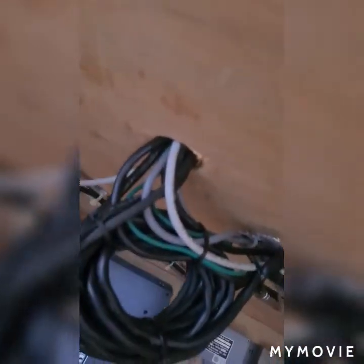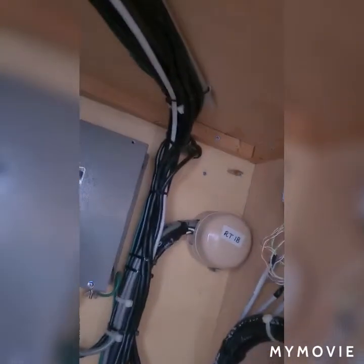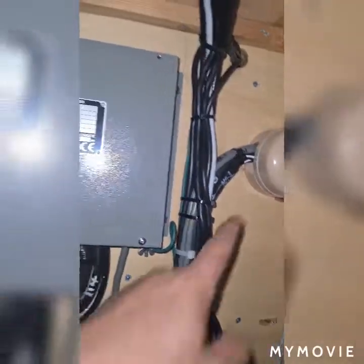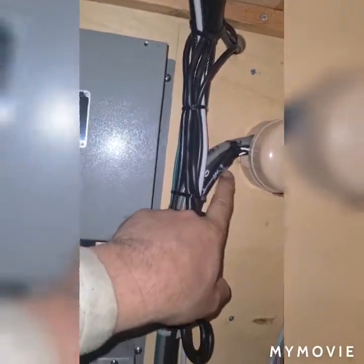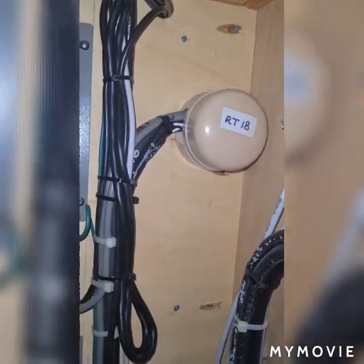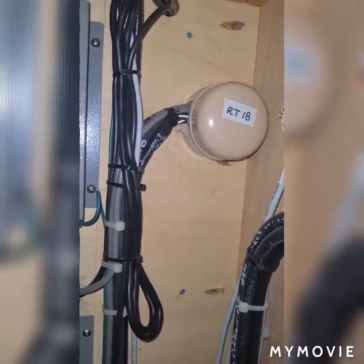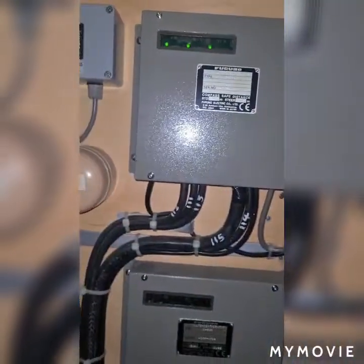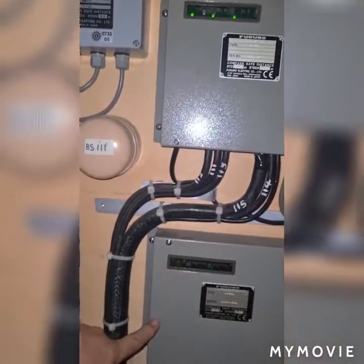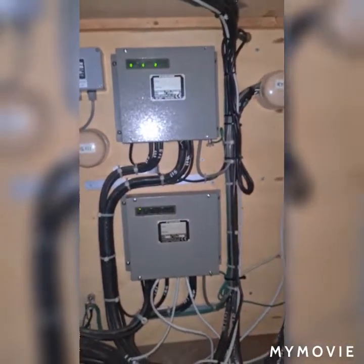The positive and negative supply for my GPS is directly passing through here and down into the cabinet. Inside the cabinet, the cable from the top passes through here. I have two cables — for GPS one and GPS two — which are the positive and negative 24 volt DC supply. I tightened the connection here and also checked the multi-distributor panel for positions one and two. Everything is now back to normal.